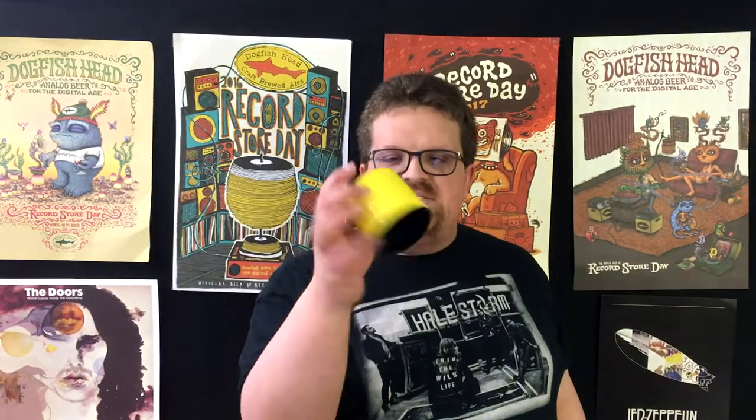There are vinyl record pellets that are melted down and squeezed out onto what's called a record puck. It's relatively about the size of this holder that I have here, maybe a little bit smaller, but it is very malleable. What they do is they put one label on the bottom, they put the record puck, and then another label, and then it is steam pressed at very high pressures. That will essentially fill in the grooves of the record as it's pressed. There is some excess, so it is trimmed off. After it is pressed, it is lifted off and moved onto a stack and taken off for later.